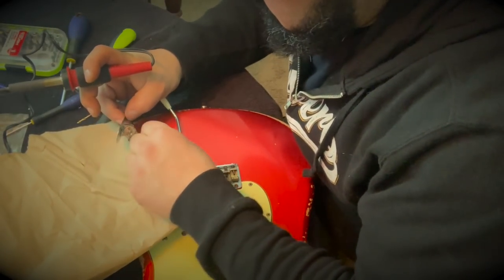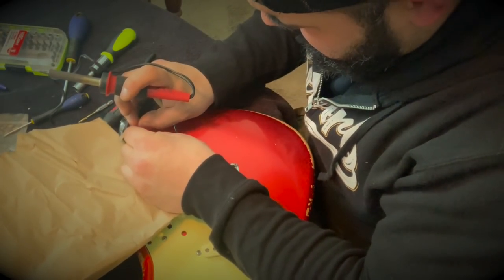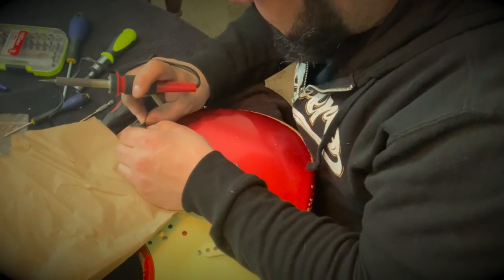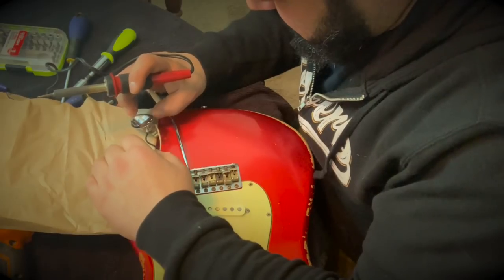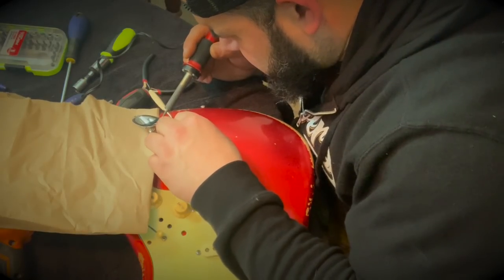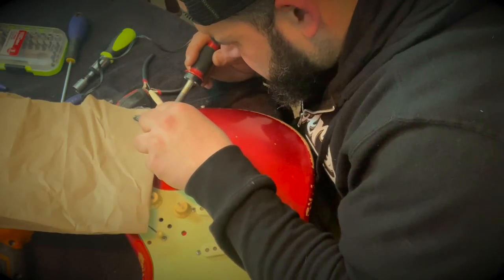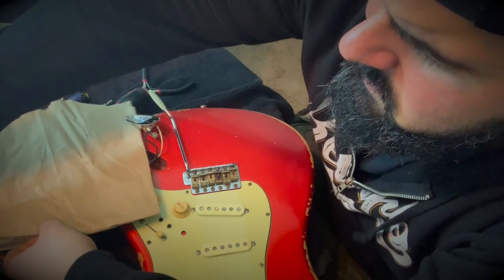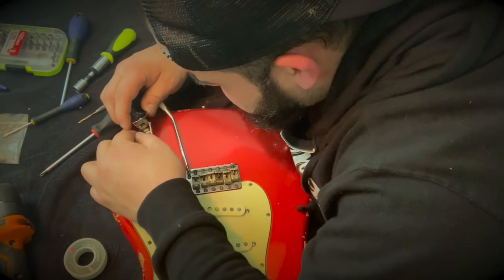Some guys with soldering too. You know, maybe I'm not the guy to give anybody advice on soldering. We all kind of pick up our different methods over time. But I found that as long as you have good heat in a clean area, just like welding, if there's any welders out there, they can attest to this, that if you have a clean area and proper heat, you'll have a nice solder joint. You just gotta be patient. Let that solder do its job. It doesn't take much. There you go.